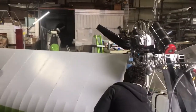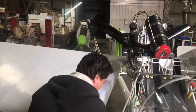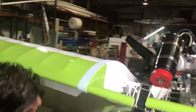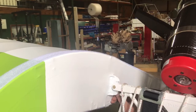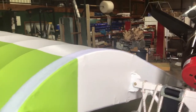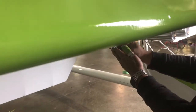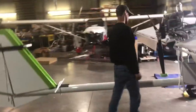Duane's going to watch what's going on up top to make sure they don't get into the exhaust system — just like that — and rotate right up. Then he's looking for that position and he's going to pin and clip it. It's best to put these hairpins in as you go, just to make sure everything gets completed if you're going from trailer to flight. He's got that pinned and clipped.